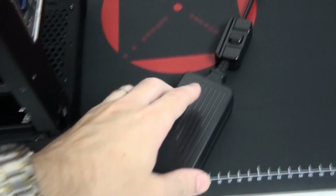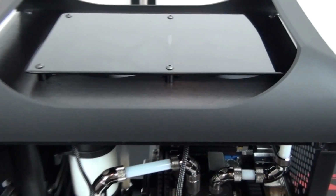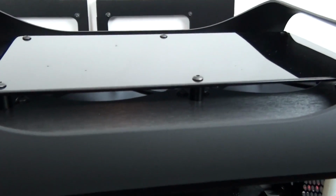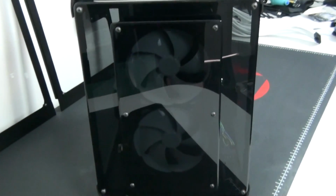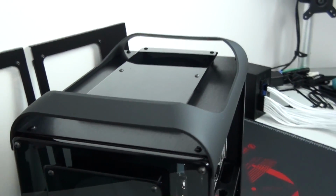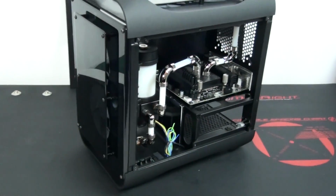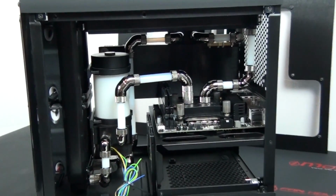But I knew that these fans definitely could be a problem, so I'm now testing them with an external power supply. When I first switched them on, they weren't a problem, but I knew that the fan blades were going to be close to the radiator, so I shook the build side to side slightly, and sure enough, the fans touched the radiator. And, again, not just slightly, the noise was terrible, almost bringing the fans to a stop. So these fans cannot be used in a pull configuration.